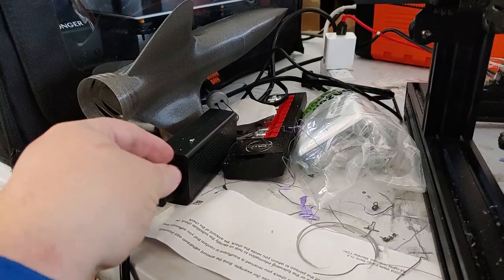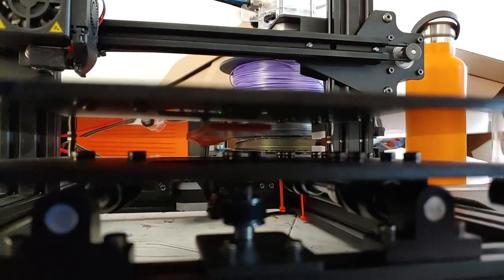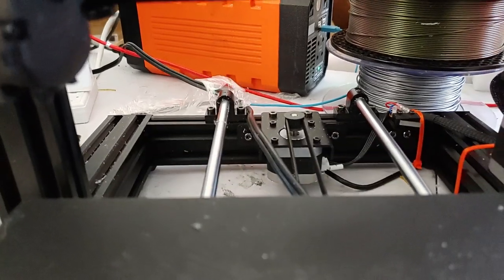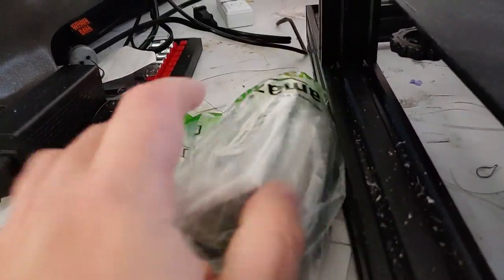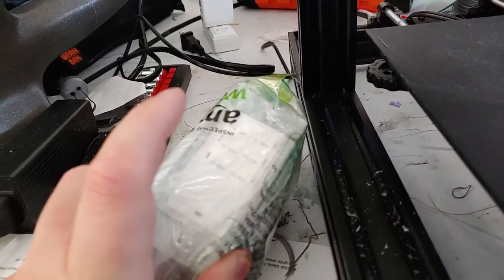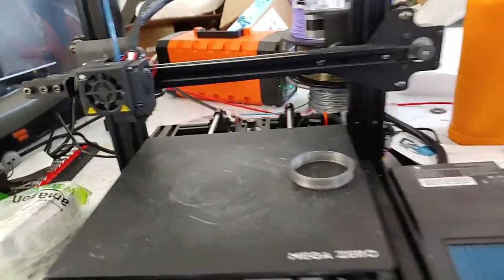There we go — a nice UL listed power supply. Right now I'm going to replace this bed with a Wham Bam bed. You can see under there my 25 watt heater pad that I installed, and there's the AC cord coming out the back right there. It slides nice and smoothly. I'm going to add some tension relief to prop that cable up a little bit to keep it away from the mechanics. Then I just plug that in whenever I want to use it. This here is the switching unit — I can turn it on by pressing this button, and if I press one of these other buttons it stays on for X number of minutes. I'm only going to use the 30 minute option. This is designed for fans and heater blowers in your bathroom. So I'll just press — 30 minutes — and 30 minutes later the heater will turn off automatically, because once you get the print up high enough you don't need the heater anymore.